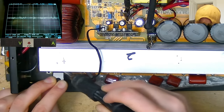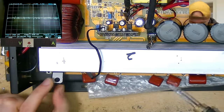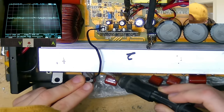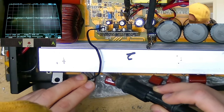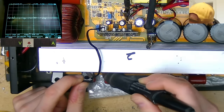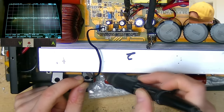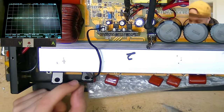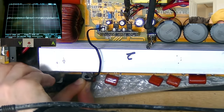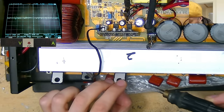So yeah, just going to drop these initial replacement IGBTs back in, just to see whether having a diode across them changes how they behave. Because if they look absolutely sweet as a nut with the diode across them like they should have, then I'm just going to use these ones, because I matched the specs of these based on the original IGBTs that were in this, whereas the other IGBTs I've got were for other amplifier projects. They weren't optimized for what this circuit wants, although they're still probably going to be fine.